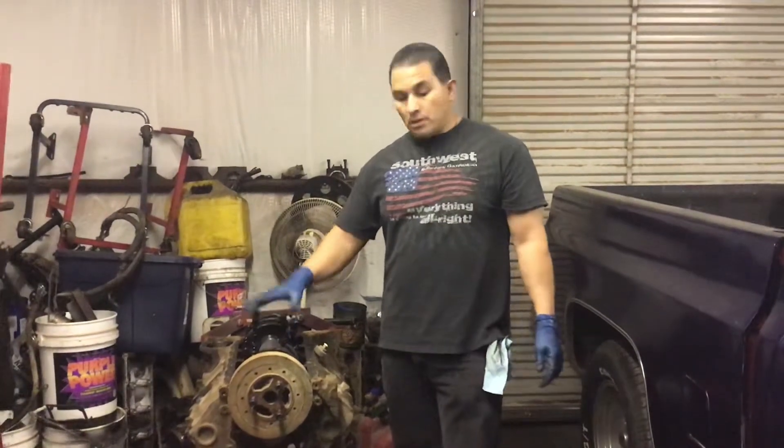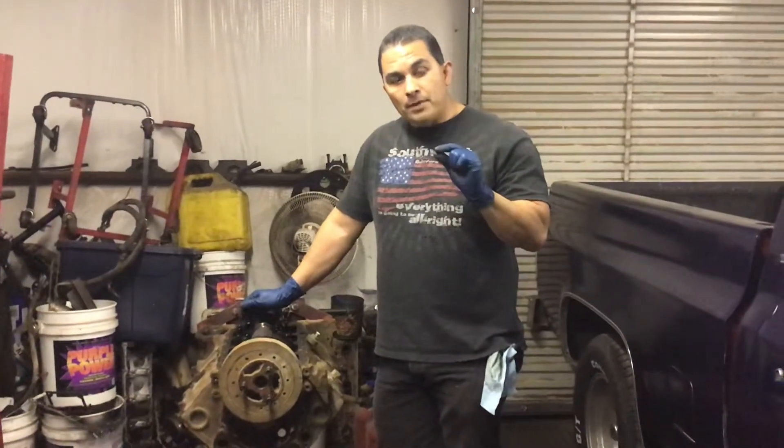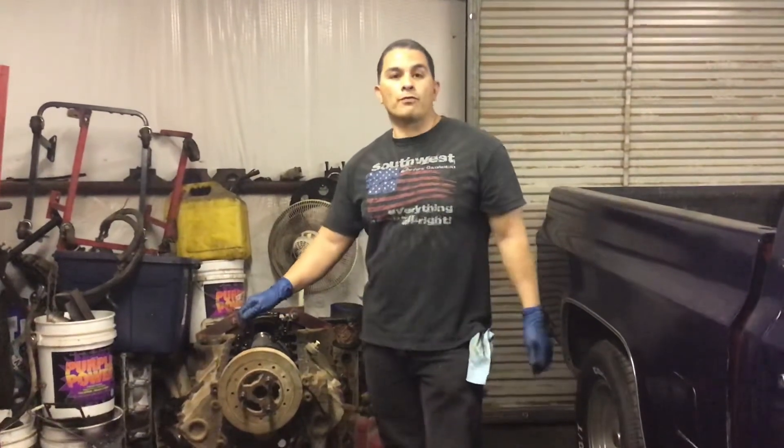I just wanted to show you a quick video on a small block 350, and hopefully this helps. If you do hear a rod knock, stop it — don't run that engine any longer, because this is the damage that's going to happen and it's going to cost you more to rebuild it. A tap is going to be a lifter; a hard knock is going to be a rod bearing. I'll do a future video when I come across a knocking engine so you can hear the difference yourself. Thanks for watching, and please share this video.